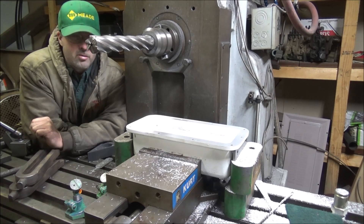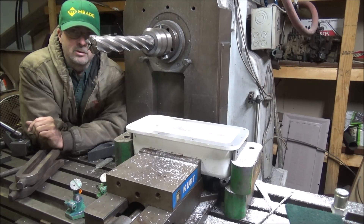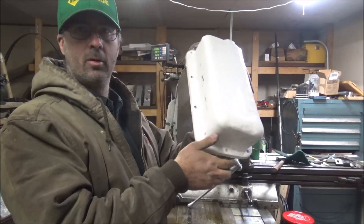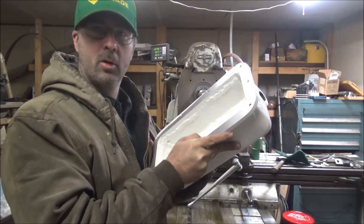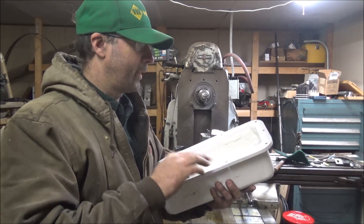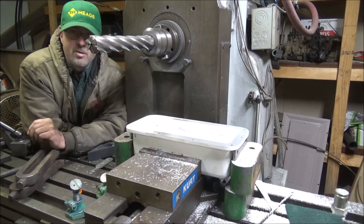So far I'm satisfied with how this is turning out considering the basket case it was when I started welding it up. It sure looks a whole lot better, and it did hold water in the water test. The paint inside should help seal any porosity that's still left in it, so a little grinder and paint action certainly made this look a lot better than when it started. Not the prettiest thing inside, but for my first piece of cast aluminum TIG welding put back together, I think it turned out all right — especially not having holes and porosity in it. Next up will be getting this put back on the lathe, getting it filled up, and maybe getting some power hooked up to see if it'll even turn on. Thanks for watching and thanks for subscribing, I'll catch you later.